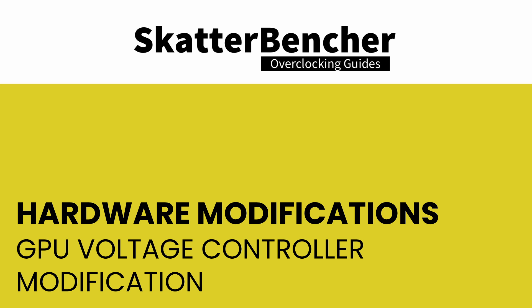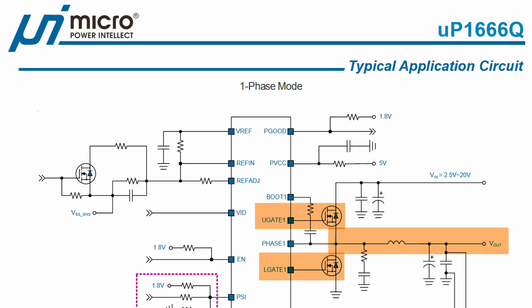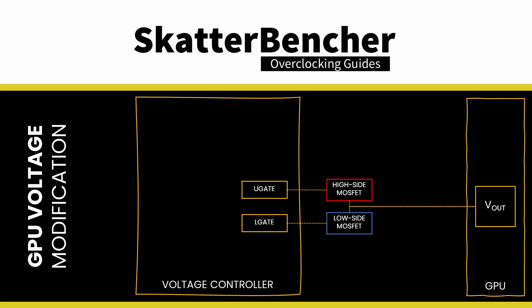Our goal is to manually increase the voltage output. In the datasheet, we find a typical application circuit where we can trace back Vout to U-gate 1 and L-gate 1. The upper gate (U-gate) and lower gate (L-gate) connect to the high-side and low-side MOSFETs. To keep it simple, the MOSFET is a transistor controlled by the gate signal that will switch on and off. In this case, the high side connects to 12V and the low side connects to ground (0V). The MOSFETs output this 12V and 0V through an output filter which averages out these voltages to provide a smooth voltage output.